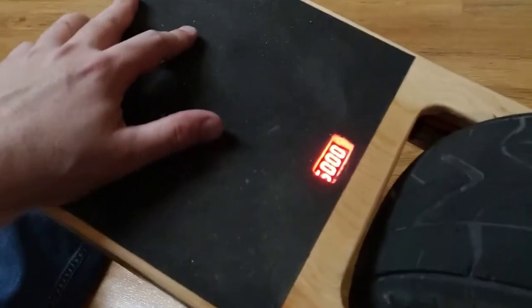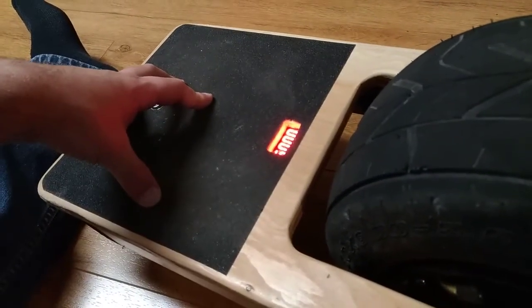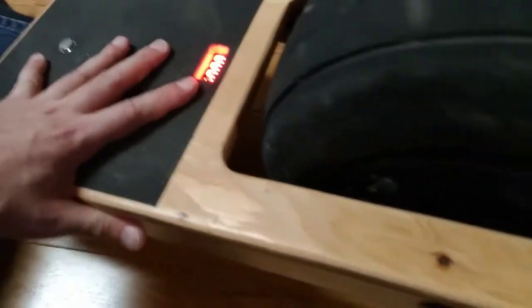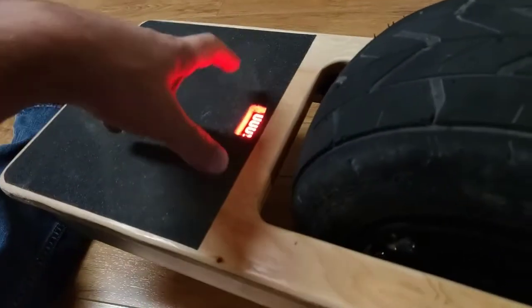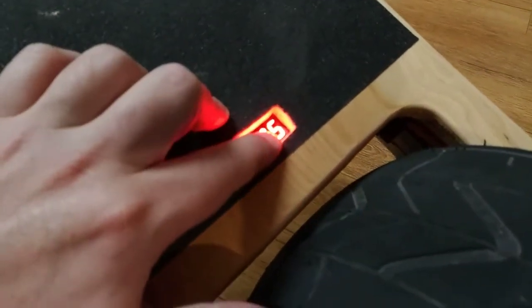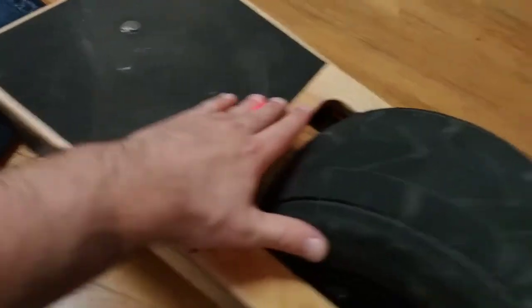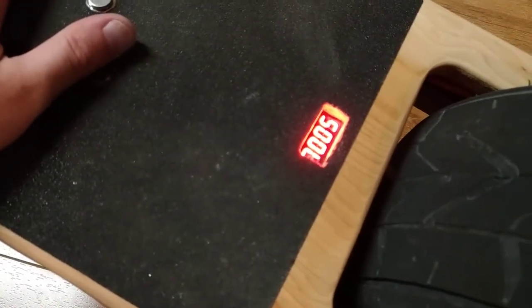The next setting is start speed, mostly useful if you're running a DC motor. Once you get past 0, it starts at this value and then adds the multiplier value to get you going. If you need 2–3% throttle to get the motor moving nicely, you set that here and it adds to whatever comes out of angle times multiplier. Setting seven is the kick: once you reach max set power, it kicks 5% throttle at the board, causing it to lunge forward on the wheel and pull back. You can increase or decrease that value.